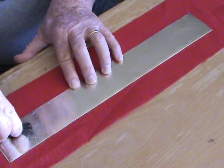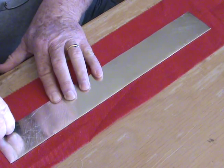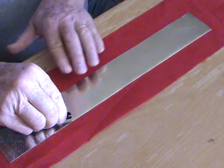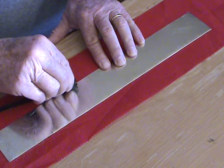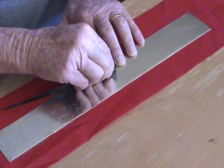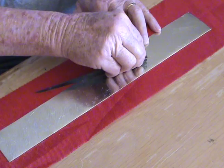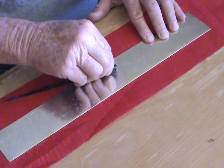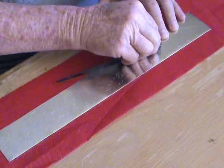The metal attaches very poorly to a wooden substrate because the wood has a tendency to move with moisture and dryness, whereas metal does not do so much, and therefore the adherence is very difficult. The original methods with which they used to do this was to use garlic to put on the backside, and then later use fish glue.